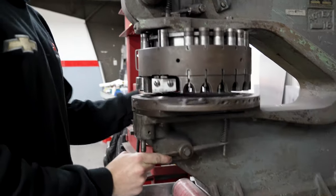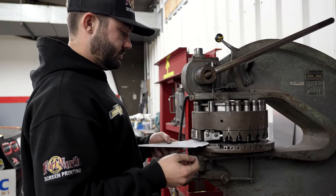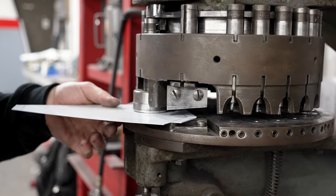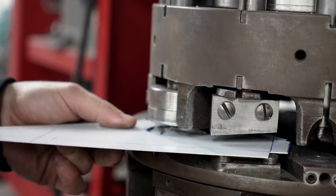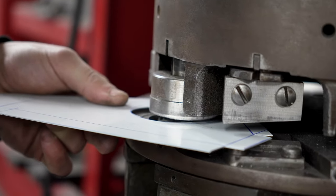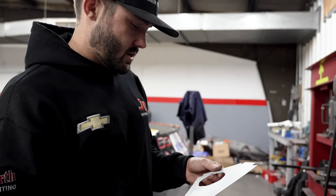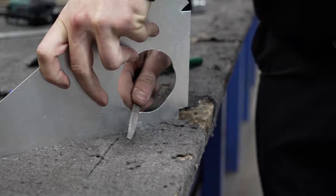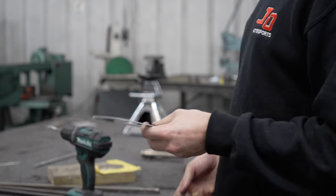This is another tool that you don't realize how convenient it is to have until you have one. You can make anything you need to make with this. Obviously this isn't the right size die — it's a two inch die and it's not going to get me all the way. But being that it is round, I can just kind of nibble my way around here. Pull it out. Now you can see how it's not quite smooth around there. I'll grab a file, file that down, get that right down to that blue mark. These small files actually do alright on the rounded edge. Might have to pull out the big guns.